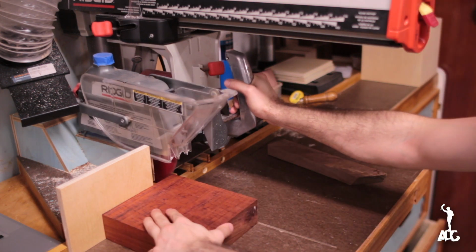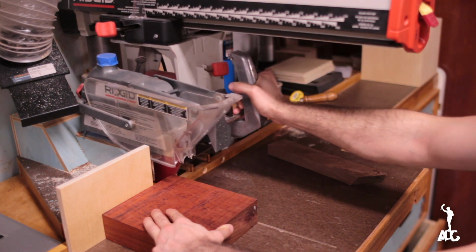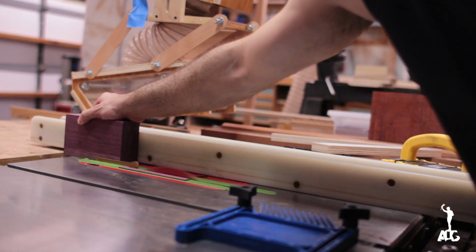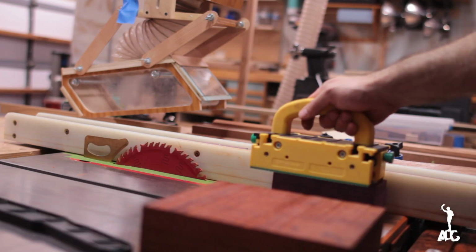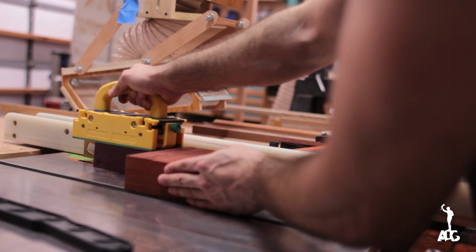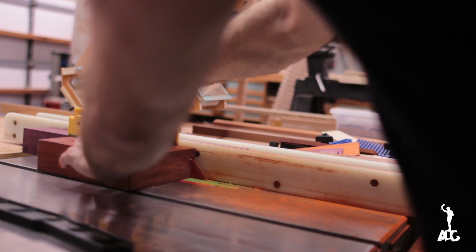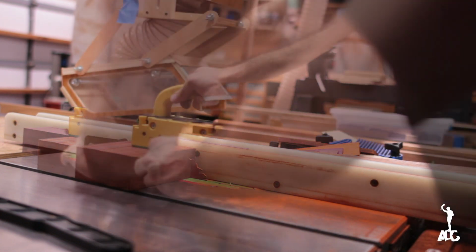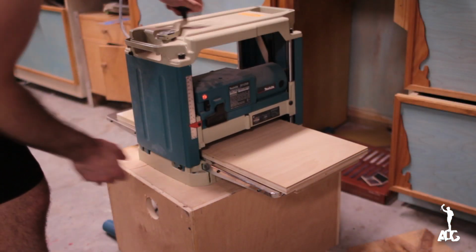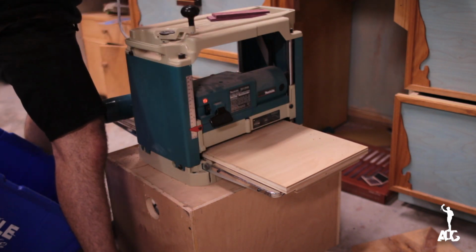I added this piece of plywood because the block of paduk is a little bit too thick, and the blade of the radial arm saw would not start without giving some clearance. Here I'm using my paduk block as a backer board for the purple heart, so I'm basically gang cutting the two blocks at the same time. But I chose to stop the saw because I didn't want to risk any wood flying over, since I was performing quite a difficult cut.